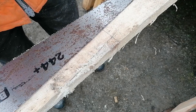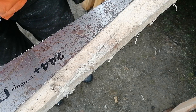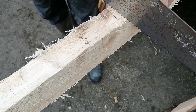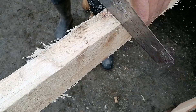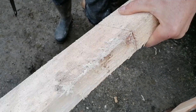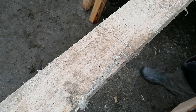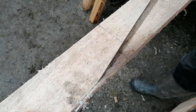This wood is still quite wet — it was only milled a few days ago — so the circular saw struggles a little bit. Now I'm going to cut down this line, square across the face but at the six degree angle marked on the face. Then it's just a case of putting the hand saw into the slot made by the circular saw.